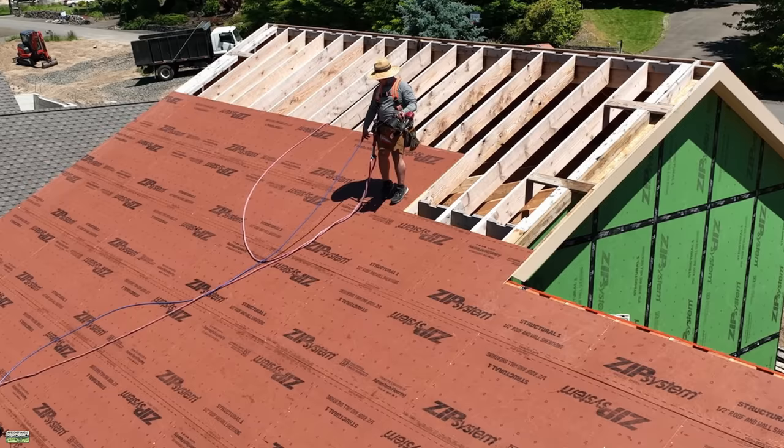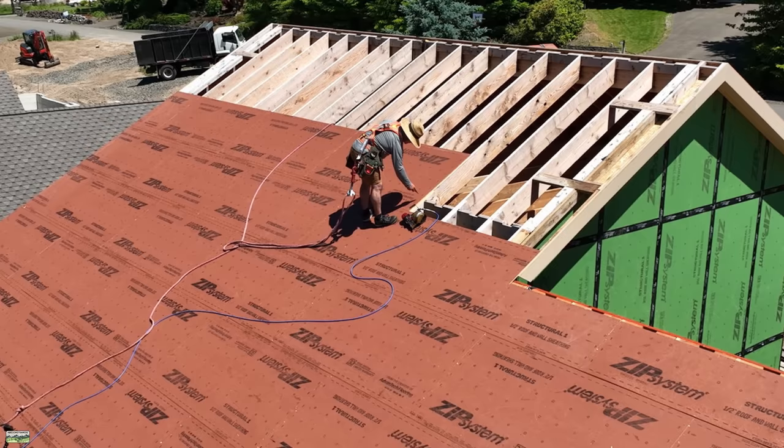There is another annoyance about a rope, harness, and hose — it's the nature of it. Yes, it's true: you can trip over the cords, you can trip over the hoses. You can even see my rope is a little twisted up. By the way, I'm snapping lines over that block line so I can nail it. We always have to fasten our roof diaphragm or the sheathing to bird blocks and any blocking that's called out — same thing up at the ridge. And look, I've turned around just like I was telling you not to do. It happens.